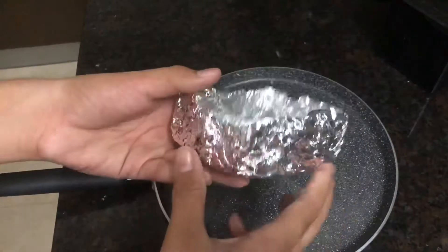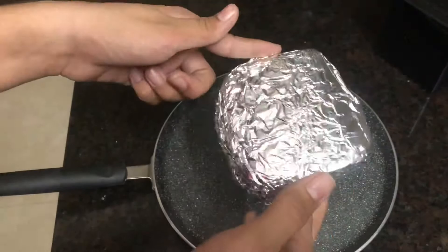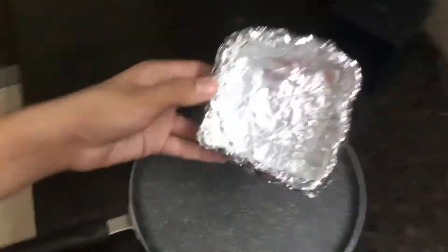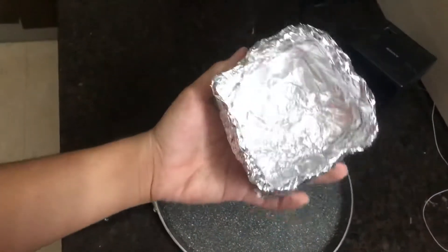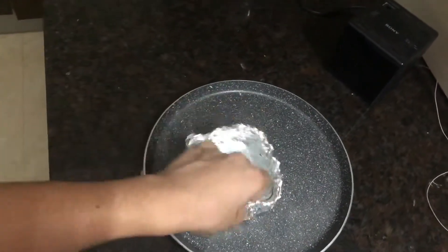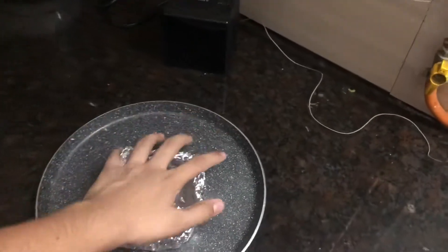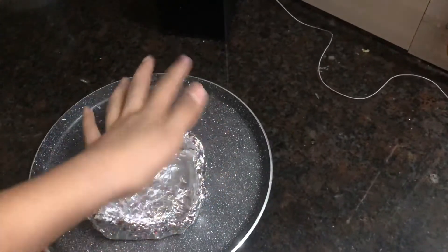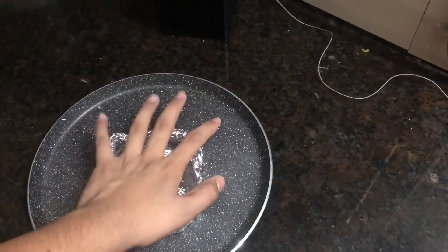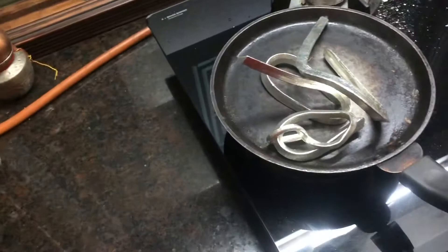You don't have to build a proper furnace — the low melting point means you just take some simple molds, like aluminum foil. Aluminum won't melt on a pan since it has a much higher melting temperature compared to tin. So you can literally make an aluminum foil mold and get a liquid metal cast. For a normal person, making a liquid metal cast out of stuff you buy on the internet in a pan is pretty revolutionary compared to trying to build a proper furnace. For my channel I will build a proper furnace later, but for now a stove and some tin works.